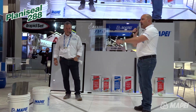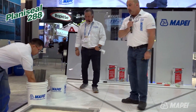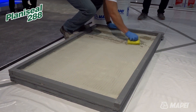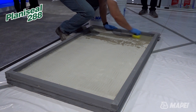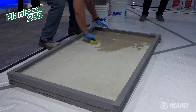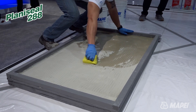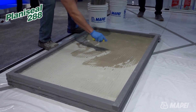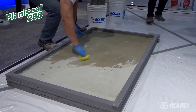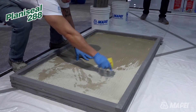So what we're going to do first is, this is LeMay — he's going to SSD the substrate. SSD: saturated surface dry. What he's basically doing is wetting the concrete substrate and making sure that when he puts down his waterproof membrane, all the moisture is not sucked out of the membrane. The first introduction to that surface of anything liquid should be cool, clean water, so the pores get blocked and don't suck it out of the mix and dry it out too fast or make it react too quickly.